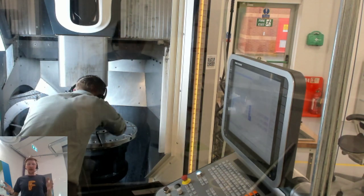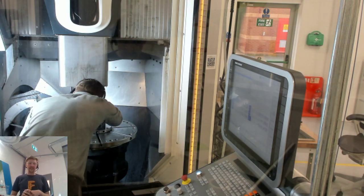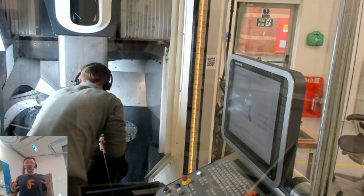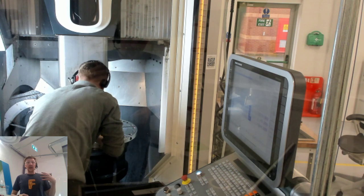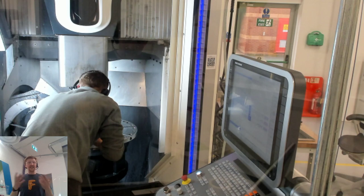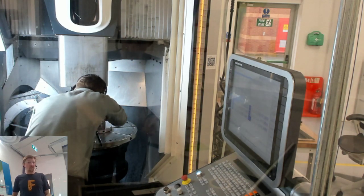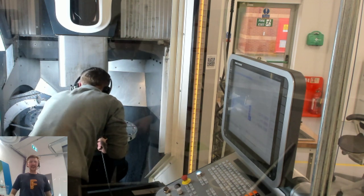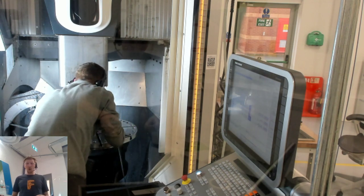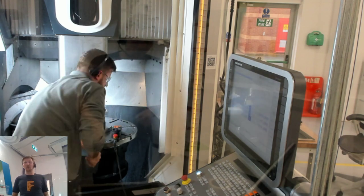Now, again, we're setting up a raw block here. I bet we could be 100 microns out, and it wouldn't make a difference. You've got to choose, effectively, what is the method you're going to use. Again, in my case, at my hobbyist machine at home, I haven't got anything like probes or calibrated setting tools. I have to just make do with what I've got. And I normally haven't got the time. I'm trying to run it between making the tea and doing other jobs in the garage. So I just try and do this as quick as I can. Normally just spinning that tool up, winding it till it touches the block. When I see swarf, I know I'm there.